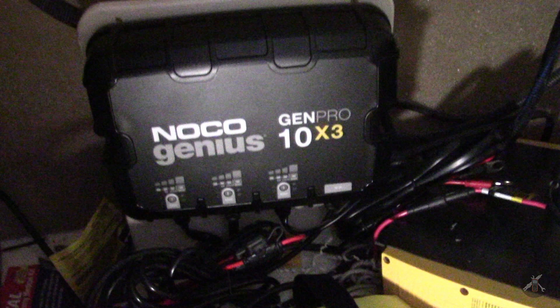I want to make it clear that there was nothing wrong with the Pro Mariner charger. Its only limitation was that it was designed for lead acid batteries, and Battle Born said I could use it — it was okay — because it limits off at 14.6 volts. Then if it goes to float, I think it's 13.6 volts as the float voltage if you let it run out that far. And they kind of want you not to get into the maintenance profile — they'd rather have you cut it off early. Nothing wrong with that charger. Pro Mariner also makes some chargers that have profiles for lithium. I just went to the NOCO because that was what Battle Born recommended, and it seemed to be a good charger when I did some research on it.